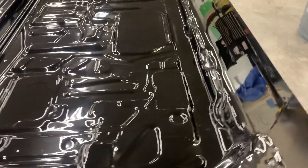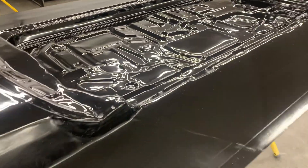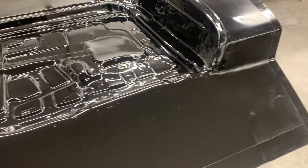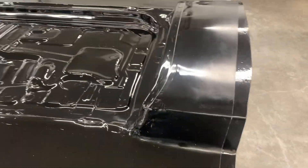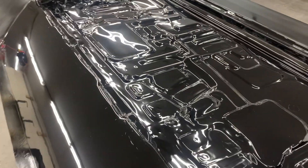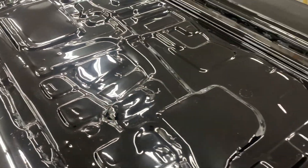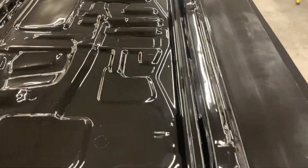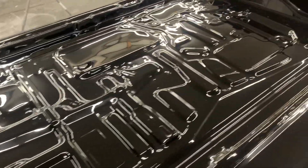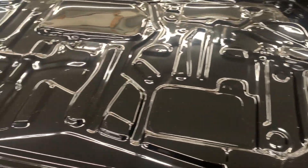So just thought I'd show you a little bit of fiberglass porn here. When people say you can't make fiberglass pieces as nice as carbon fiber pieces because the molds aren't as nice — I could make fiberglass parts out of these molds also. There's absolutely no reason why fiberglass doors can't be just as nice as carbon fiber doors, aside from the fact that most people doing fiberglass are doing molds that cut a few corners. With carbon fiber, you really can't cut corners — you have to do the molds nicer, or you end up with a junk product.